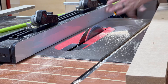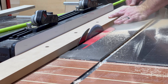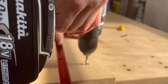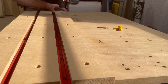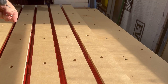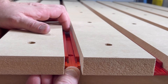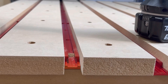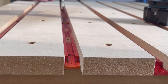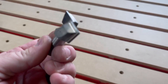Here's the mistake I made: I cut my strips just a bit too wide because I didn't accommodate for the spacing, so I had to trim these down. As I was laying these out the holes weren't lining up, but with a little more wiggle room they're lining up for sure. This is actually a pretty satisfying process — I'm using a drill to put these machine screws in, and there's a function where it won't over-tighten them. When installing t-tracks: make one self-tapped hole first, put that screw in place to lock the position, then go back and drill your other holes so they don't wander.